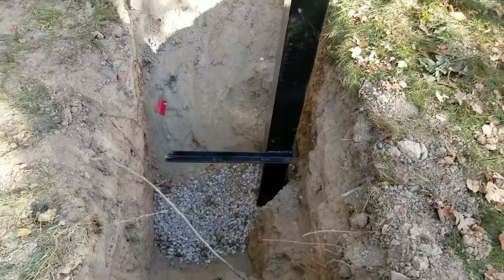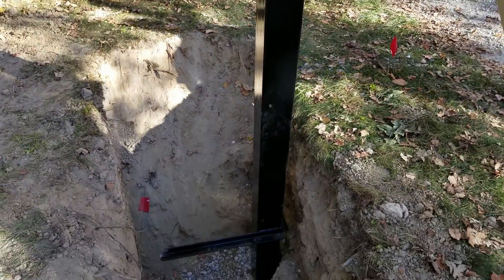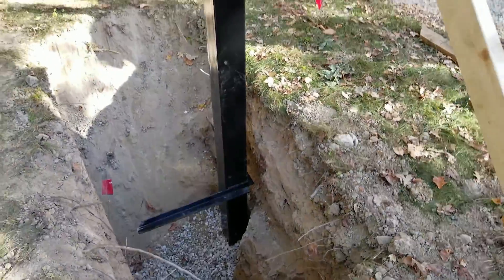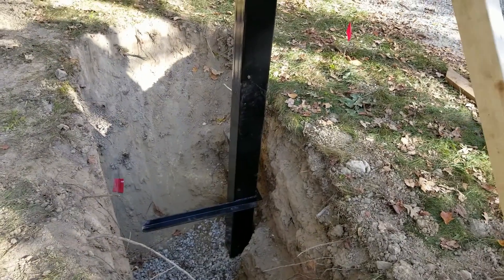All in, I think we're going to bring about six yards of concrete — so a neighborhood of about 25,000 pounds or so. I think that should hold these posts; they're going to hold 300-pound gates in place. More to come. Alright guys — concrete day. Chris was over here during the week finishing up the rebar cage on this post behind me, and we actually tightened up both of the holes so we'd save a little bit of concrete.